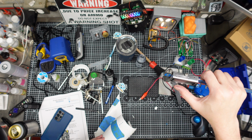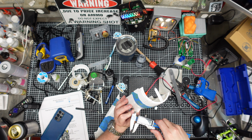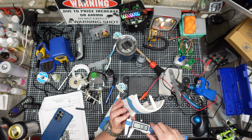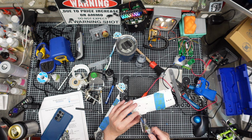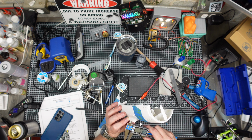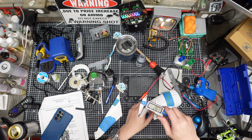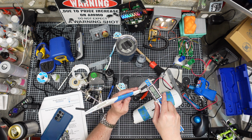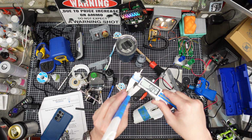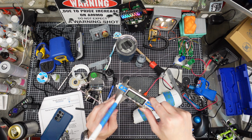Use your brains and your tools. Okay, zeroed. And right in the middle, the thickest part: 542, 545, 541, 536. That looks like about the thickest area. Let's see. 546, 557. Okay. And then we just go to the thickest area right here at the base of the pylon. What do we got there? We got more millimeters. Woof! A little over 6 millimeters.